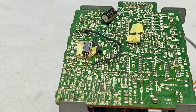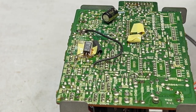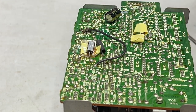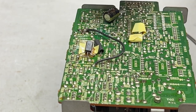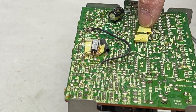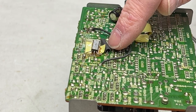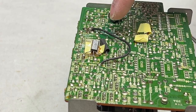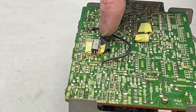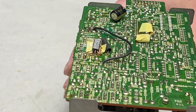All right, folks, I think I've got everything done in terms of the system control board here, or Mecha control board, whatever they call it, I don't know. As you can see, I've done a lot of work on the backside of the circuit board here to get rid of all the old nasty brown glue that was up here that goes conductive. There was a lot under this capacitor and some under here and a lot under here as well. And this resistor was glued down. And rather than mess with the Kapton tape there, I decided to just throw the resistor in a little piece of heat shrink tubing to keep that insulated. But everything should be good now.